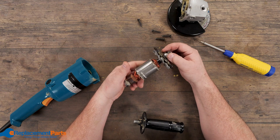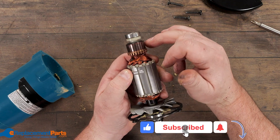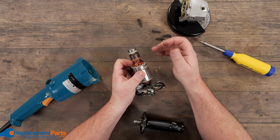If you're getting sparks — just like any other electric motor — it's probably because your brushes are getting worn. If I look at this one, the commutator, I don't see any black on it, no burning, so that's looking good. We don't have any issues with the brushes.